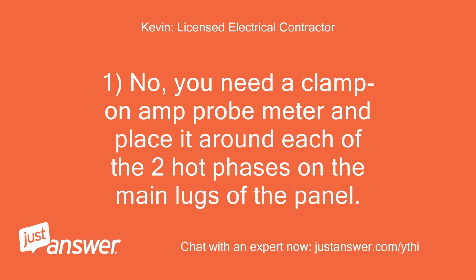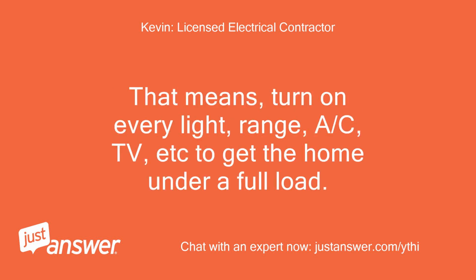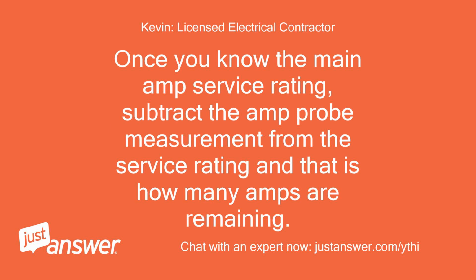No, you need a clamp-on amp probe meter and place it around each of the 2 hot phases on the main lugs of the panel. The house needs to be under full load as much as possible. That means, turn on every light, range, AC, TV, etc. to get the home under a full load. Once you know the main amp service rating, subtract the amp probe measurement from the service rating, and that is how many amps are remaining.